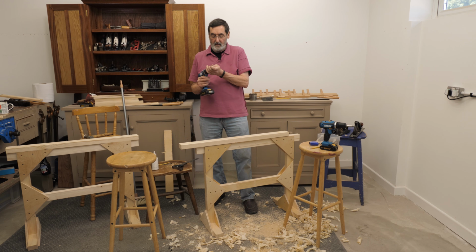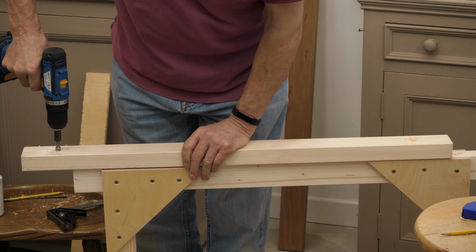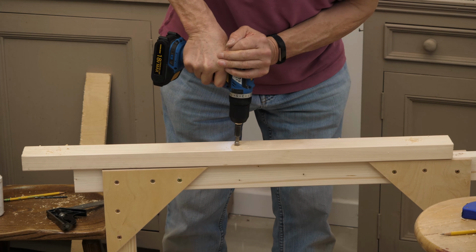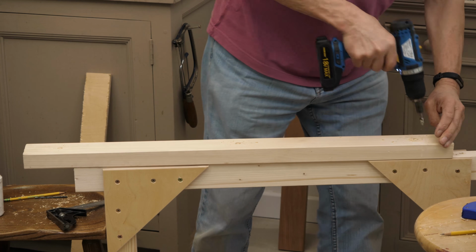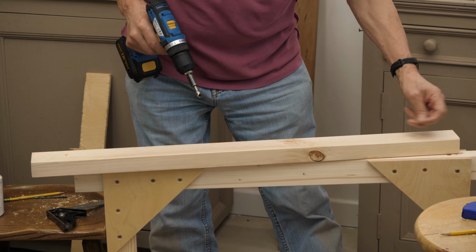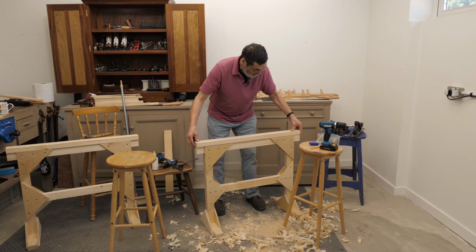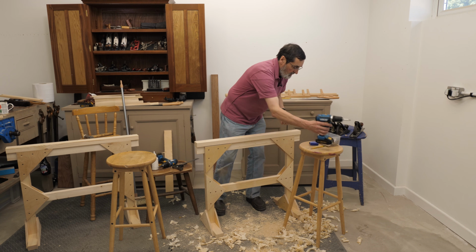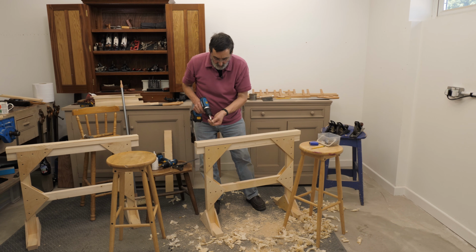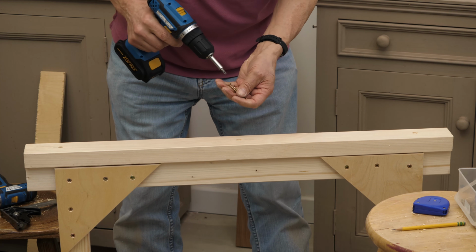We're done with this. So it's very fast. I'm going to countersink the underside. Well, oh no, I'm not. No, it's pretty good. No need to. So this goes here, centered over there. Should be flush with the outside or near flush with your gussets. 3 screws. That's perfect.